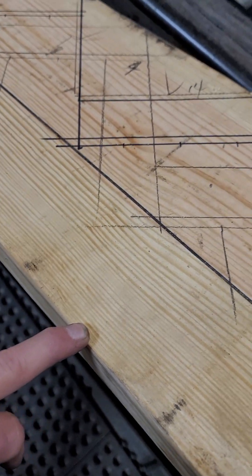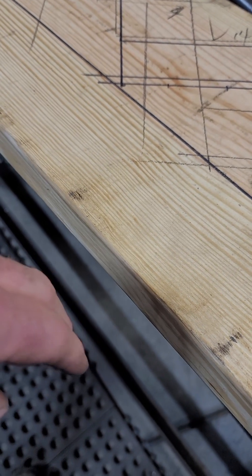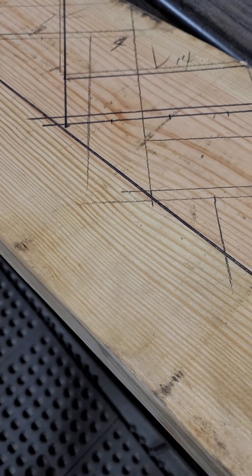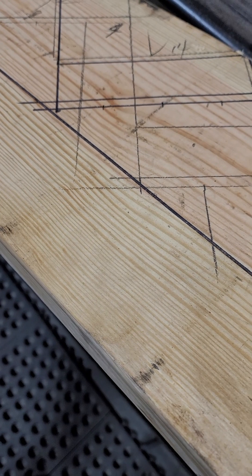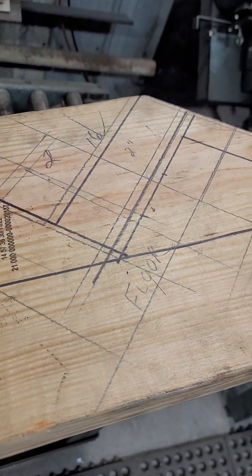That's about four inches, but there's actually another two inches below if you figure the full width of the beam — it's six inches, or the height of the beam, because I'm using a six by eight turned flat. So it's eight inches wide. I lay it out, get my distances, and calculate where my pedestal placement is.